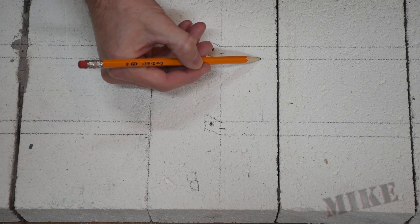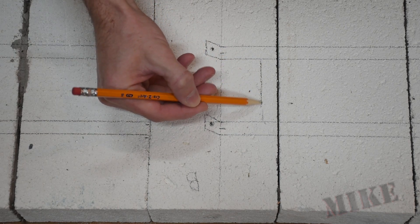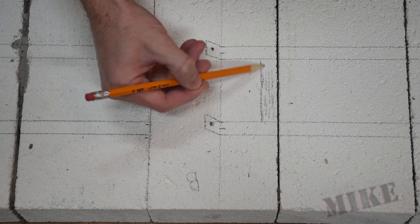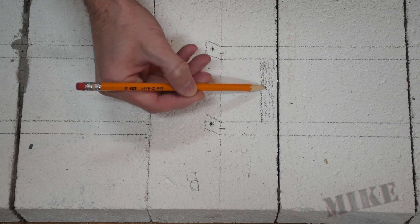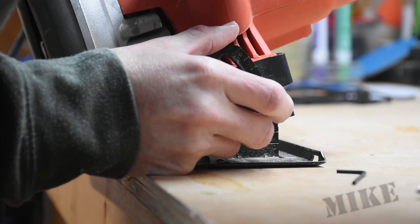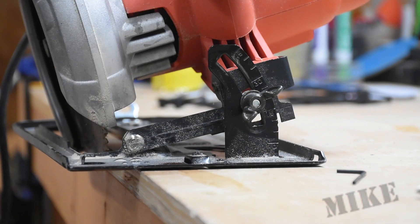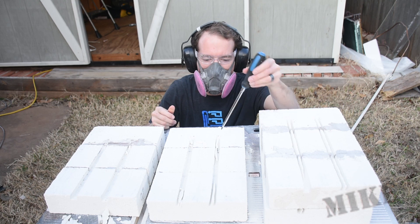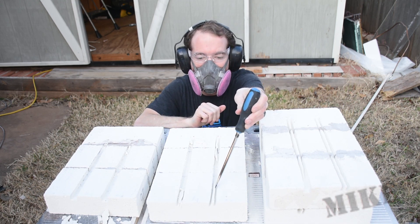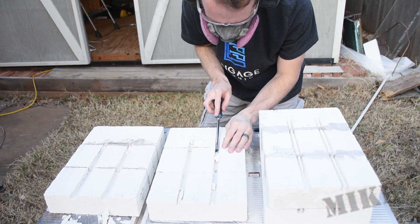Here I've got to have a place for the coil to turn around and go back the other way, so I only want to destroy one brick. I'm going to carve a slot right here where I'm shading — that'll help me see what I'm doing later. I set my saw to a half inch deep and 15 degrees, so as the coils expand they'll sink further into the slot, like I did with my last large one. I cut on each line and you can see how easy these things break free — just a quick little pry with a screwdriver, then clean up the bottom just like so.